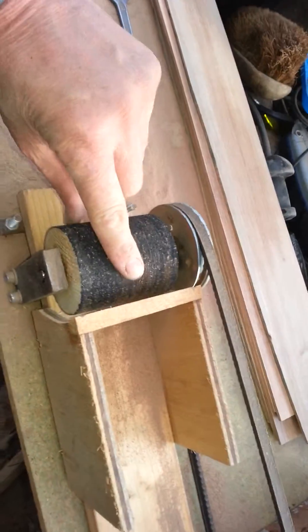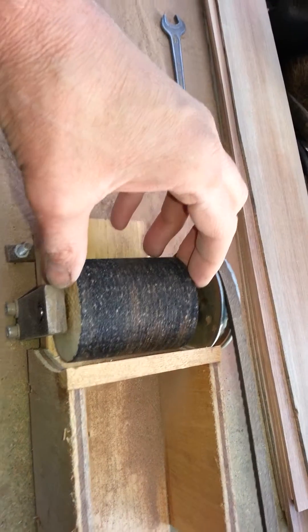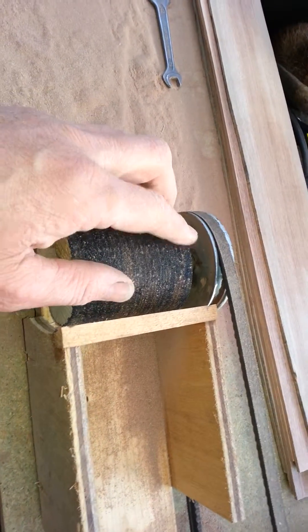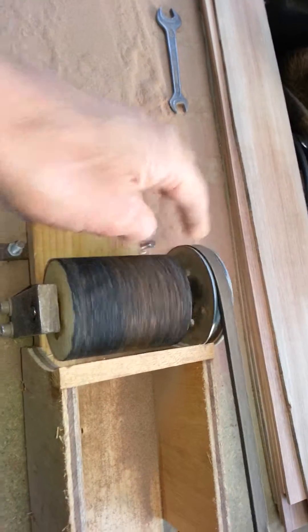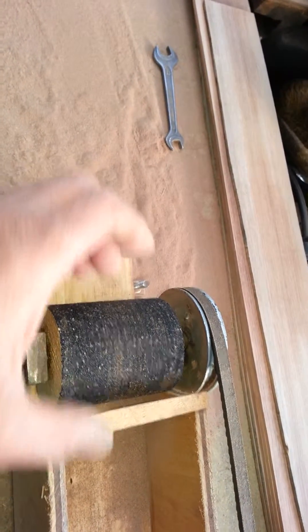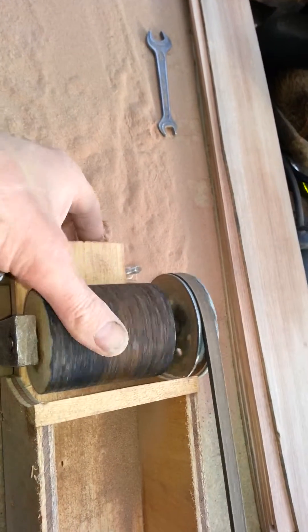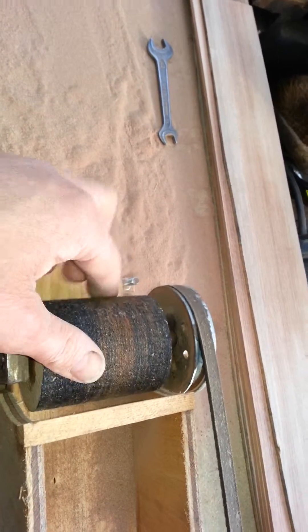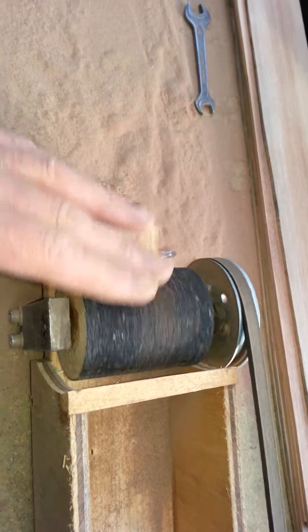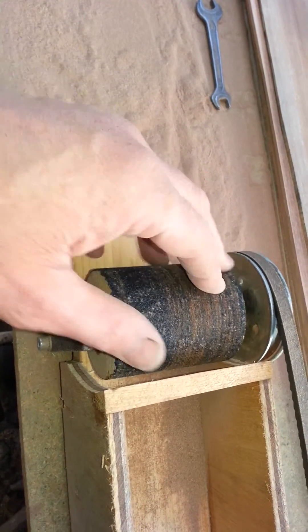Basically I've turned in wood this cylinder just a little bit wider than the section of what I'm using, mounted it on an arbor, and then with everything running, sanded the outside of it flat to make sure that there's no eccentric movement. Then I've taken it off, glued it with a very strong wood adhesive, and then dipped it in carborundum grit.